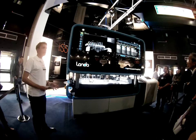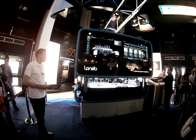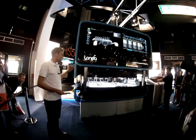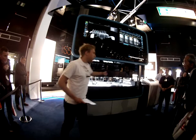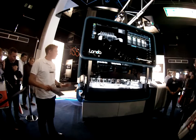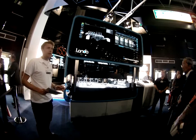Watch how easily you can access the interior of the press. You just lift the screen and the blanket conveyor system and you can access any part inside. So take a look at the feeding, delivery, and paper handling system. They are based on reliable offset configuration and support any substrate, including coated and uncoated stock, specialty papers, and even synthetic media from 60 to 350 GSM.